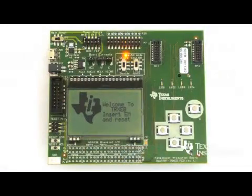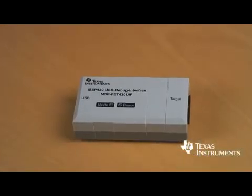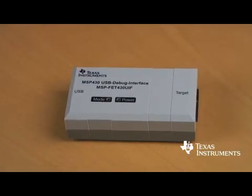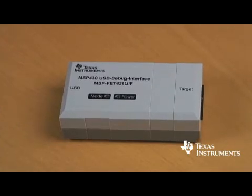When you're doing development you have Smart RF Studio to generate RF settings and RF registers. Are there any other software tools that go with this development kit? Yes, you can actually use this board together with our packet sniffer. With the RF module and the development board connected to the PC, this board acts as a capture device for our packet sniffer. And if you want to develop software, the kit includes the MSP430 debugger, so you just start IAR Embedded Workbench or Code Composer Studio and then you can develop software.